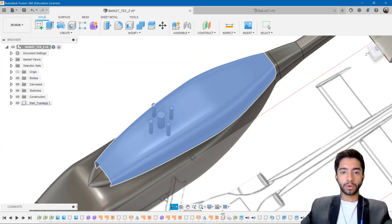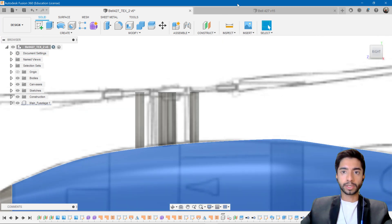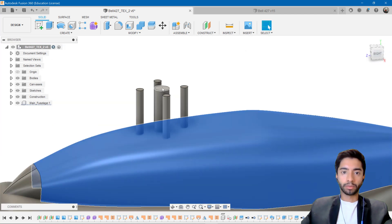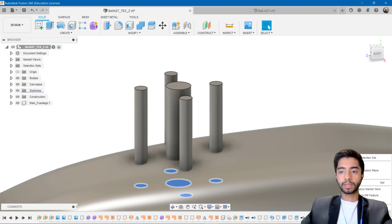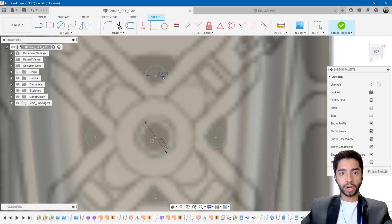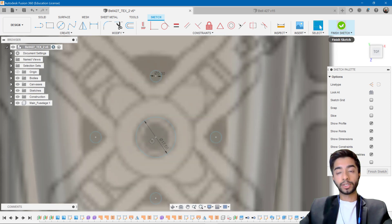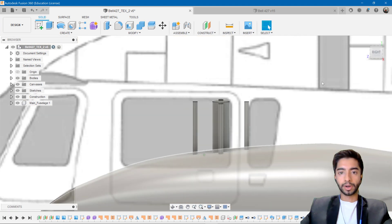So now we can see these four sections. In my opinion, they're a little too thick compared to what's in the blueprints and my previous model. So I'm going to go back in time and edit that — I'll leave the middle one as is but reduce the size of the smaller circles. Go back to the timeline, right-click on the sketch, and click Edit Sketch. Instead of 9, hover over the circle, double-click, and change it to 5. The other circles automatically get smaller as well. When I finish the sketch, Fusion automatically updates the thickness of these members.